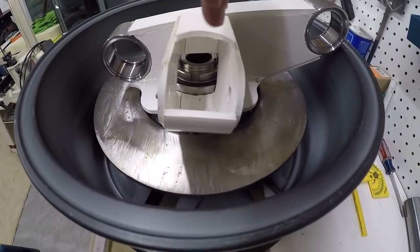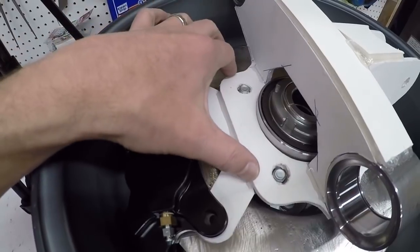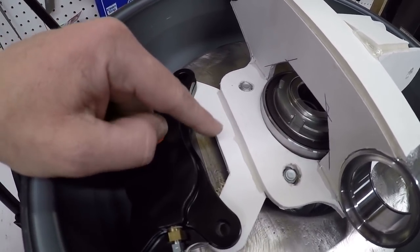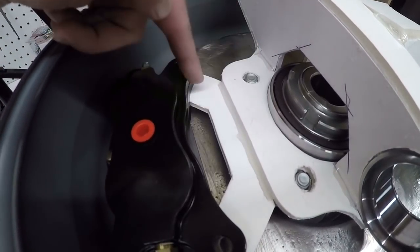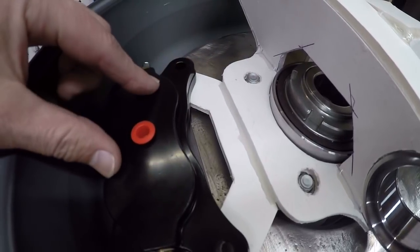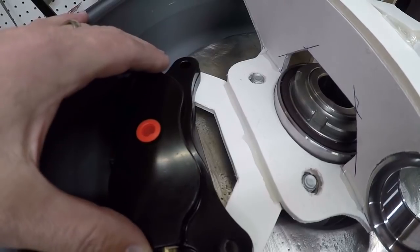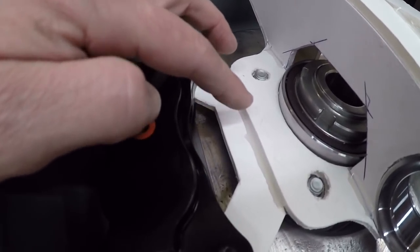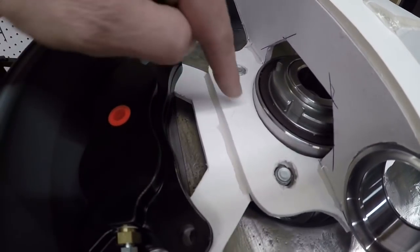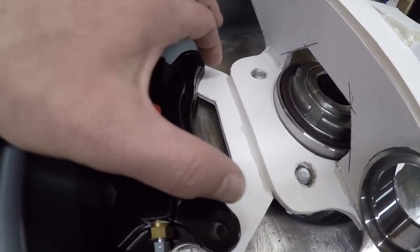It is angled 8 degrees up to help with the angle of your steering arm coming down with your suspension. Over here is going to be a 1/4 inch plate that the hub bolts to, and I made the caliper mounting piece separate because they're not at the same elevation. When I build this, I'll make the main piece and the caliper piece separately, bolt everything on, clamp down the caliper so it's all where it needs to be, then weld it along there and add a couple of pieces for structure. Doing it that way, it will allow you to run a vented rotor if you need to — the vented rotor sticks up a lot higher so you'd need to trim this piece a bit and custom make the bracket.